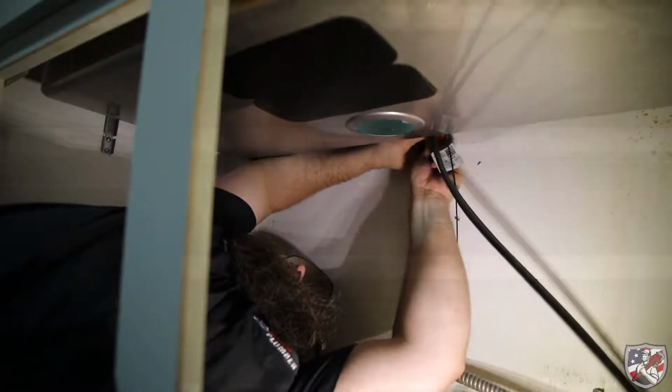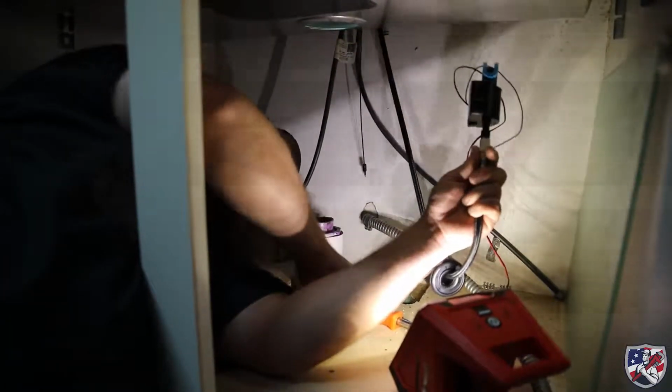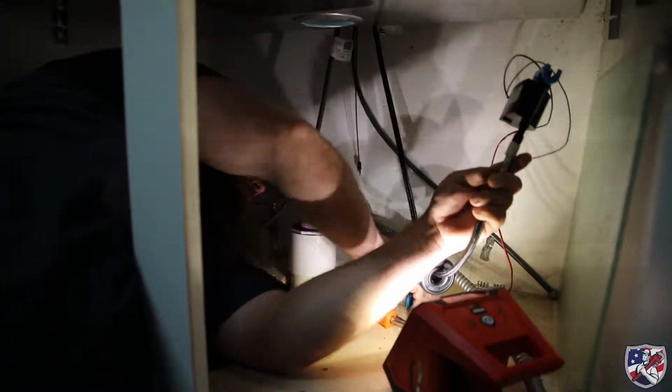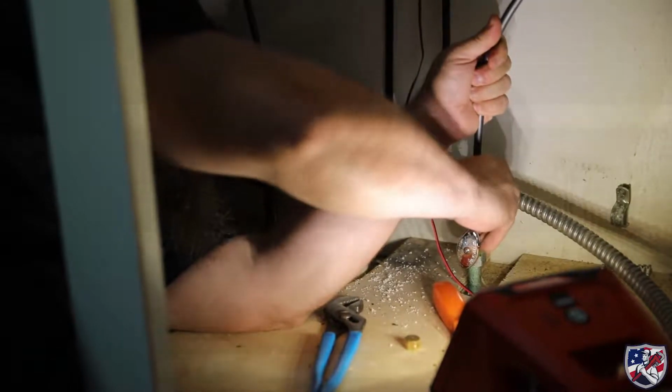With the faucet in place, we secure it and tighten it in place with the faucet's provided bracket. Make sure you install the weight on the main water line for the faucet, as without it, the faucet will not retract easily. With the faucet installed, we can install the water lines, making sure we have the hot and cold lines on the sides we want them on.